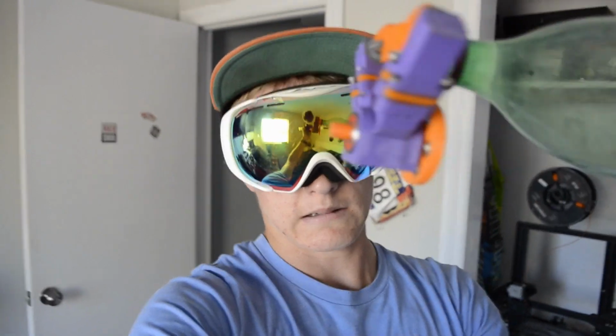I wanted to chase efficiency first and try and design a more efficient engine, but also, I've already tried with my V-twin engine. The main problem with having an airlock valve system like that is the fact that there's way too much friction, it's extremely difficult to start, and it's extremely aggravating to have to reprint parts for this. On top of that, there's no way for it to be a 4-stroke because every time the piston goes up, it lets air in. So I don't know how to make that a 4-stroke in the first place. So I'm gonna have to redesign my entire engine from the ground up.